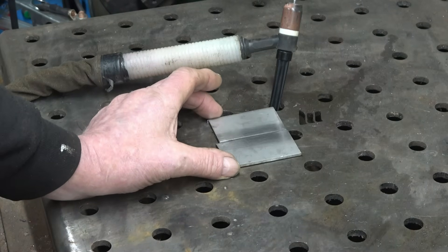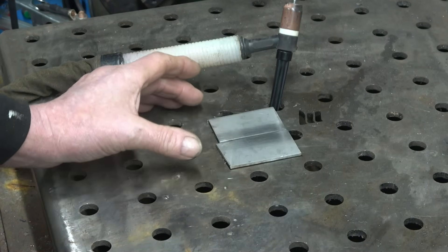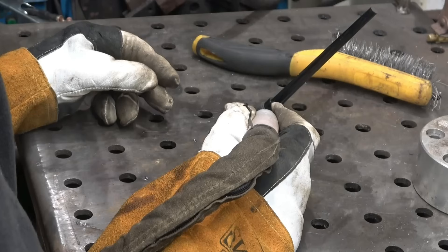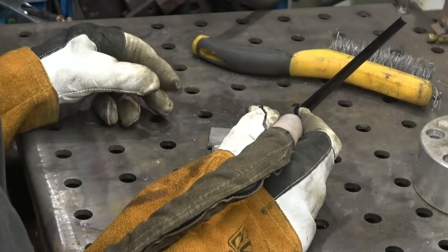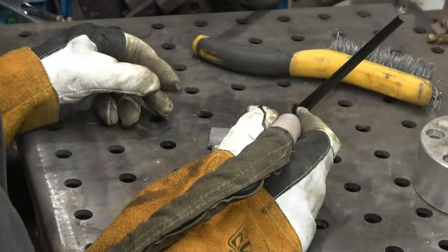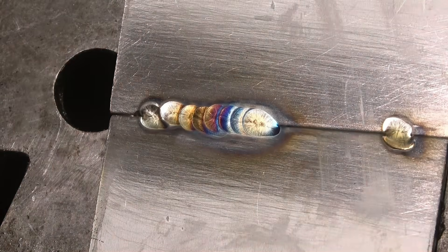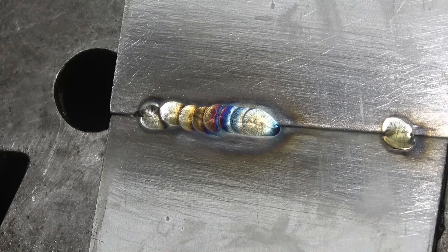This is the same material we're going to be welding — 4mm stainless. I'm going to try and get a decent arc shot of the spot welding process before we move on to the real job. The spot weld fires autonomously every two seconds. All I'm interested in is doing the one spot weld to join them together, then I'm going to use a pulse weld to do the job.